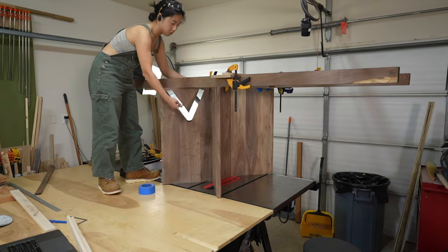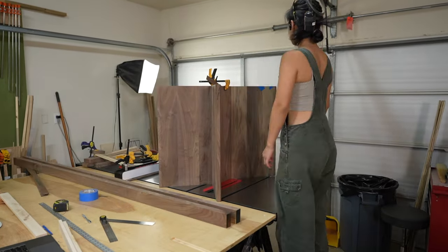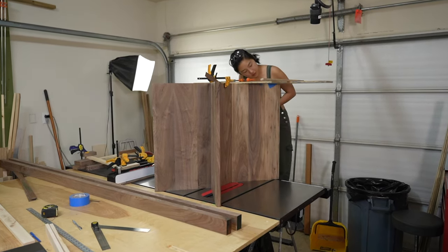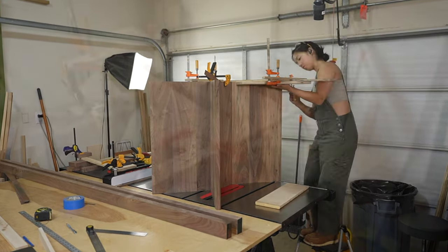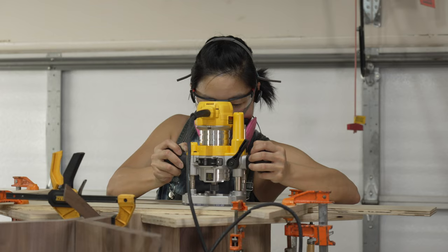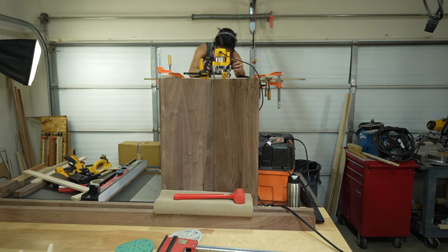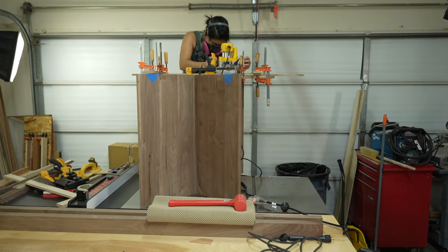While there are a lot of advantages to going the half lap route, I would really have to put a lot of considerations into how the bullnoses are laid out and do a lot of extra cuts for individual pieces. I just wanted the bullnose attaching process to be a little more mindless, so having one difficult step instead of a lot of intricate steps was the winner in my book. Even with the direction decided, there were still many ways to tackle this: a track saw, the table saw with a robust crosscut sled, or a router finished off with hand tools. I decided to go with routing and hand tools, despite the fact that hand tools are my biggest weakness.